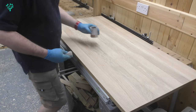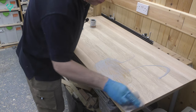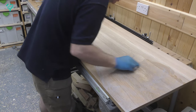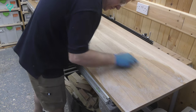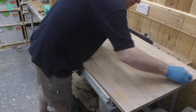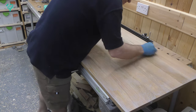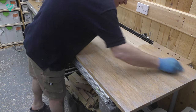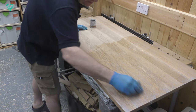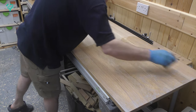It's simply a matter of applying the tint to your surface. The easiest way is to pour it on, then in circles work it into the grain of the wood. I really like these white sponges because, unlike the green sponges you see in kitchens, they're not abrasive and will not abrade your surface. Make sure all of this is worked well into the grain. Go ahead in circles — don't worry at this moment about anything pooling on your surface. Just keep working it in. It goes quite a long way. You can already see it's not sending the wood grey — you can see it beginning to pick up the grain in the material and making that pattern come to the fore.